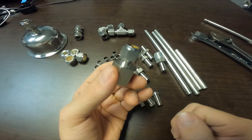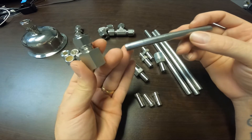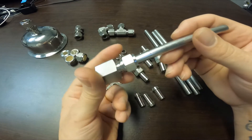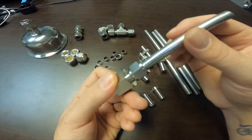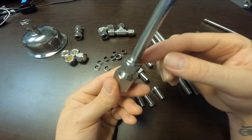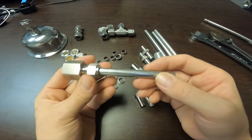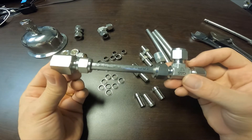Essentially, you bottom the nut all the way down just slightly hand tight. A compression fitting works with hard piping or other fittings like a port connector to mate connections together — somewhat like Legos. You tighten the nut just enough hand tight to bottom the pipe all the way down on the inside. We'll go over to the vise in a moment to show exactly how to secure that fitting, but first let's talk about the connections and how they work.